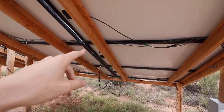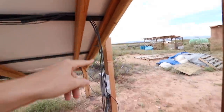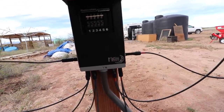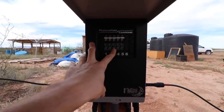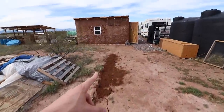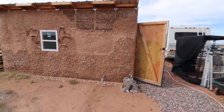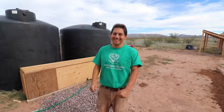So he's got three of these panels wired in series — connecting the positive to the negative, the positive to the negative, then running all the positive strings down one side, and then running all the negatives down the other. So he's got all the positives coming into the combiner box right here, all the negatives on this side, and then we've got five 15-amp DC breakers. Coming from the combiner box, I had to do a bit of a dipsy-doodle with some one-inch PVC to get to where the trench is, so those wires are trenched underground into his little fiber adobe shed. Pretty cool.